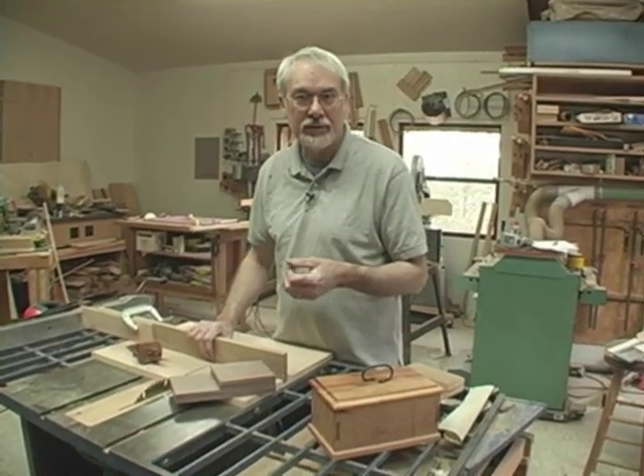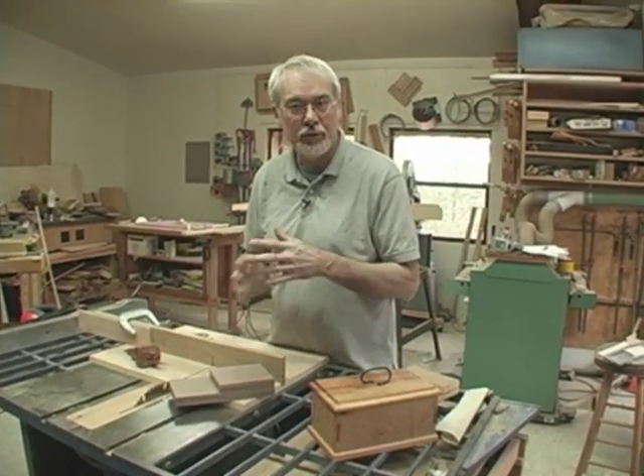Now to finish off this little box, I just have two things to do. This is a little bit of paste wax, and I'm going to use this to apply to the edges to make it slide with a little less friction. The wax will just keep it sliding effortlessly. So now I have this little brass pin — I've polished the top of it — and I just have to slip it in the hole. Because that's a very good friction fit, I'm not even going to worry about gluing it in place. That allows me the option of taking it completely out if I want, but it provides a positive stop. It's all done.